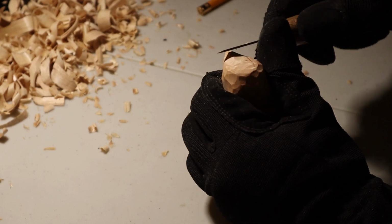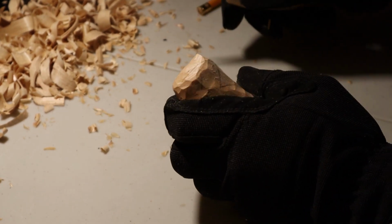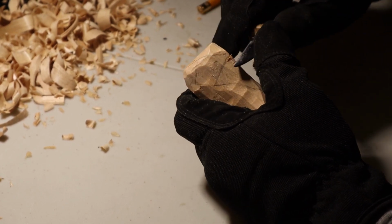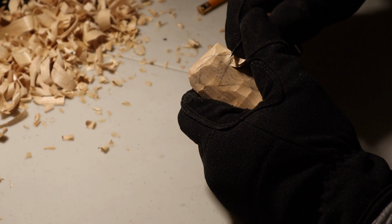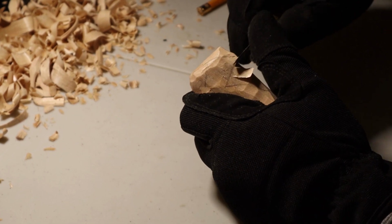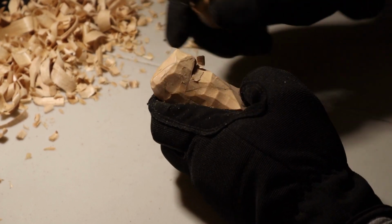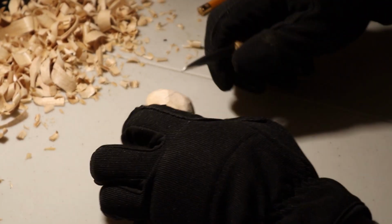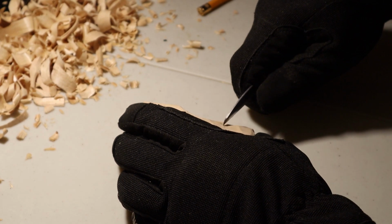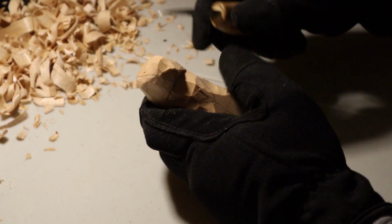Carving like this is super hard, and it splits the wood, so we'll come back from the other angle later. So V-cut, stop cut basically, and then you remove lots of wood again. It's carving in general, removing wood more and more. You can either do your stop cut already like this, or you can just do V-cuts. You will have the same result.